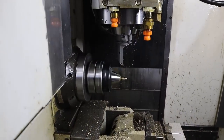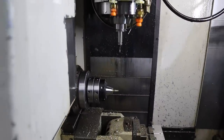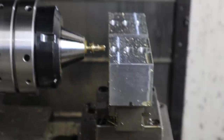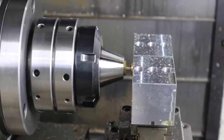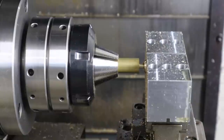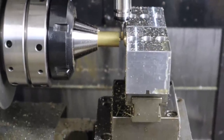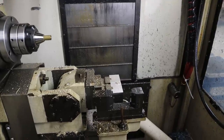Here's a 1-1/8 inch high feed mill. Do a little preparatory move. The vise is going to come up — how cool is this? It's feeding in super slowly. You can set all these feed planes and everything. Grip. Main spindle collet release. Pull bar. Clamp main spindle collet. Now the high feed tool comes in and just murders this material. Doing a tool breakage check — make sure it's still there before we continue. Speeding out, rotates down, orients the U-axis — that's the vise.